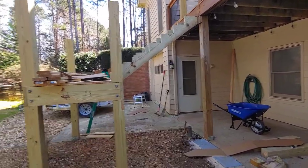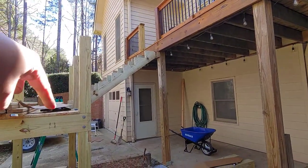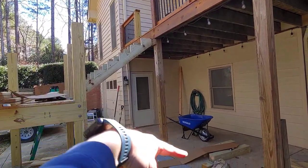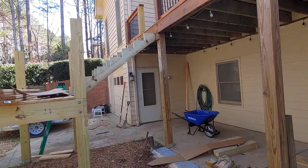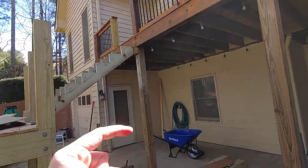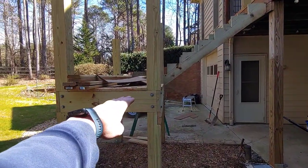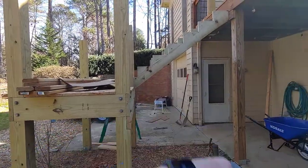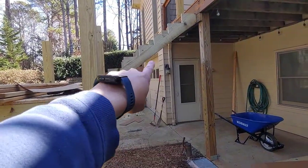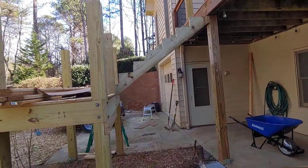In this case I'm working on the ones on my deck. My deck's new set of stairs are going to come down, turn, and go back down here. I had some stringers left over from my prior deck which ran the other way, and I set my landing to the same height as the old one, so I was able to save a stringer and use it as a template. I made some adjustments, but that's how I got the top one set.